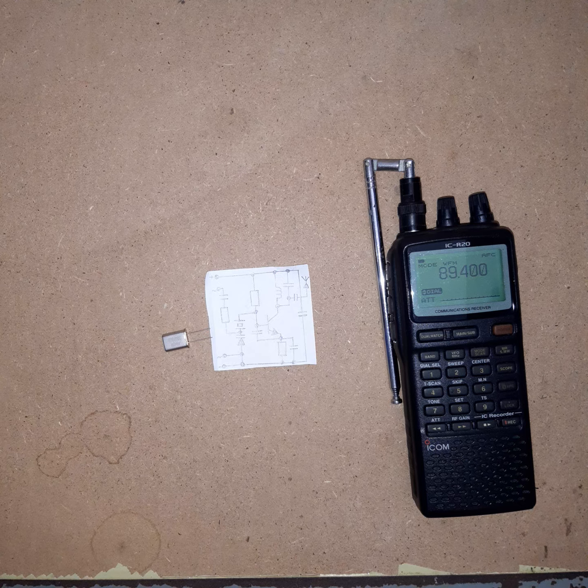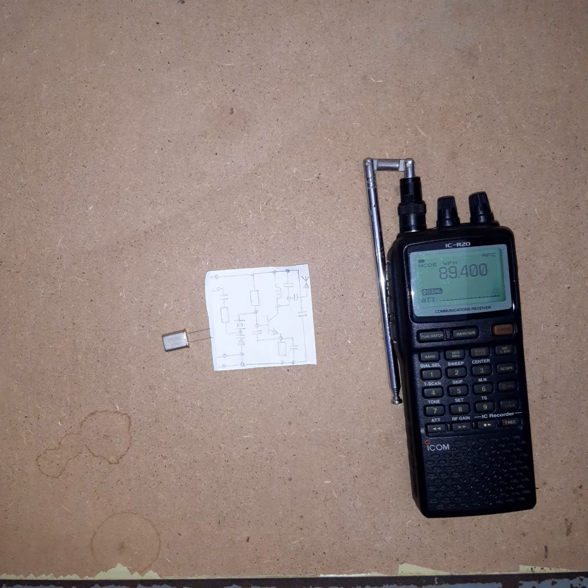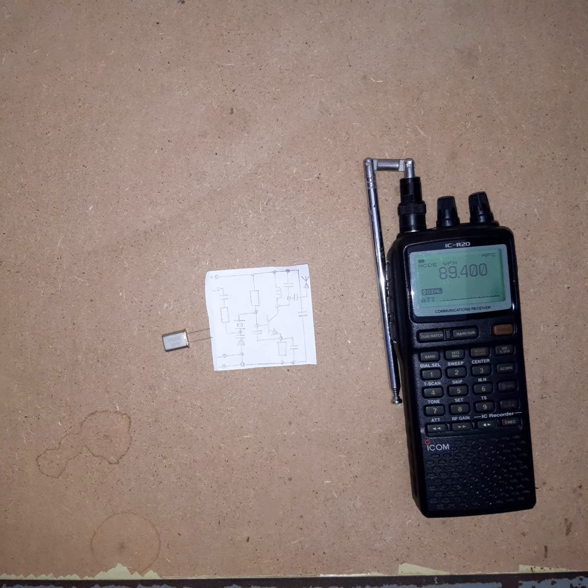And this is what the people are doing. They're adding a varicap in series to the crystal, which then gets fed the audio signal, and as a reaction, it slightly changes the crystal's frequency. There is more to say, because this is not what they want, because now they would have an FM signal on the very low frequency of 20 megahertz.